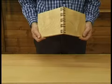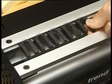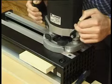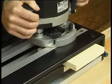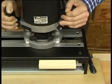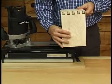Shadow dovetails with several configurations are also possible. They are constructed by moving the guide finger position to the left or the right to obtain a wider tail that is then later re-machined at the normal width. Start by cutting a light-toned tail piece, first with all the tail guides set at one notch to the right, then one notch to the left. The cutter depth must be set to 2.5mm deeper than the final mating part, and the dark-toned timber must also be 2.5mm thicker than the final pin piece — a maximum of 15.9mm. Cut the pins in the dark timber, glue up and when dry, saw off the waste. The shadows can be on all three sides of the pin, or just one or two, depending on your design.